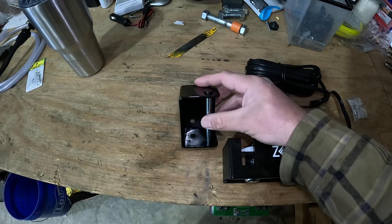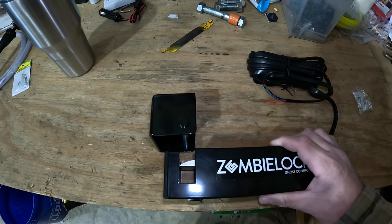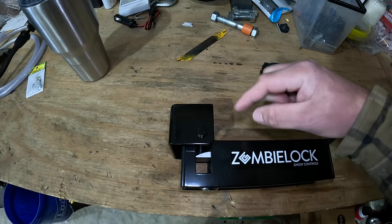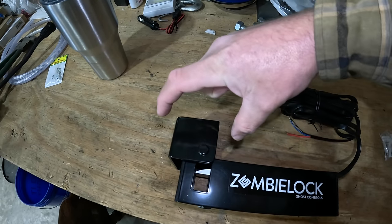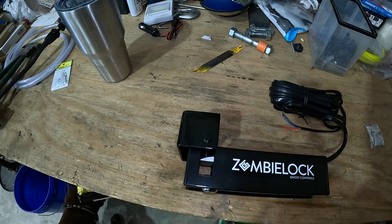And this latch mechanism has to mount to the post on the other side. And everything has to kind of come in like that right there. So we have to determine where we're gonna mount this off the post. And then, as you can see, the gate's gonna have to stop somewhere over here. So we have to come at least this far off of our post. This is gonna determine the size that we go build our gate.